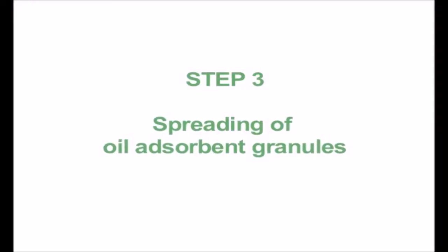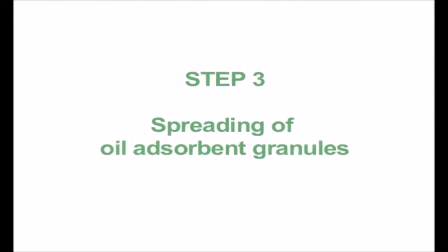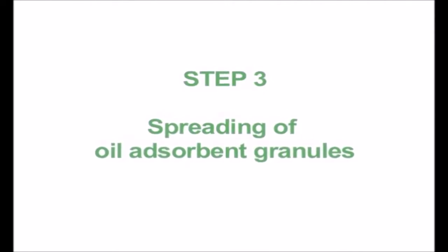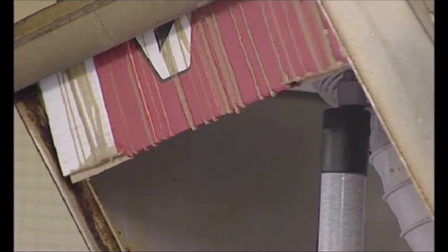Liquidy grease needs to be removed very fast in order to prevent leakage and droplets from ductwork. This can be achieved fastest by spraying oil-absorbent granules into these sections. Before starting spraying granules, remember to put the negative air unit on with the lowest possible airflow in order to prevent dust from granules bursting out from the spreading point.